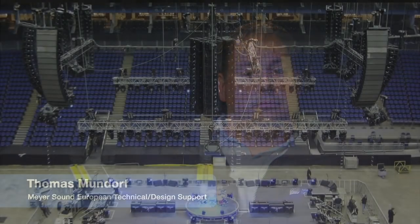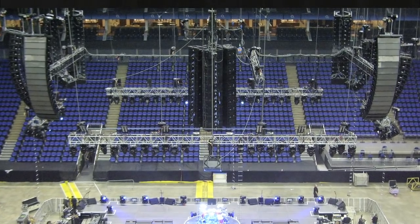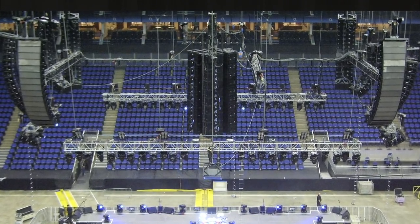The TM array is actually nothing else but a line array — it's just looking at subwoofers. The whole line array theory goes from omnidirectional sources, and it's about spacing those omnidirectional sources pretty close together. This can be easily achieved with subwoofers.